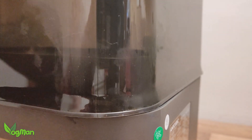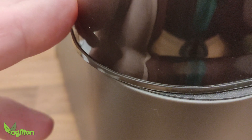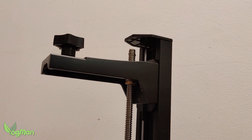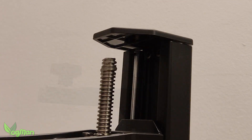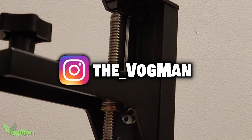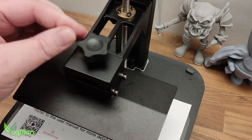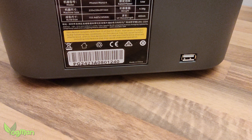The lid fits and does the job of capturing those nasty UVs, but when I say fits, it's almost a size too large. The Z upright seems rigid and firm, and the arm rides smoothly on a single linear rail. I'll be honest — I don't like the fact that there's nothing supporting the top of the screw thread, but the Mono 2 was exactly the same and that seems to have passed the test of time, so this shouldn't be a concern. The plate attaches with the usual twist of a knob.